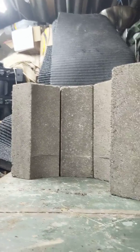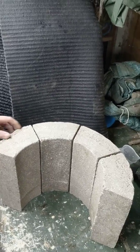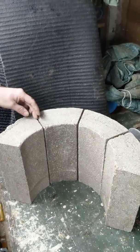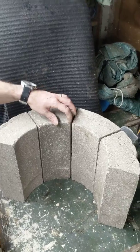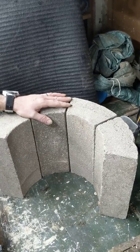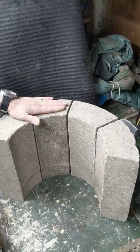They're all stacked. You can see them stacked up, ready to go there. Sorry about the camera work, it's my first video. So they'll be going into the house to dry. What I wanted to show you is the 4 ones that I got done before. So yeah, that's it basically. These will sit into the expansion vessel. This is the outside edge. There'll be a thin line of mortar, fire cement in between, and then the internals I'm hopefully coating in refractory clay, and then the tops as well.